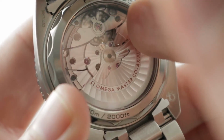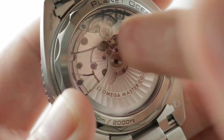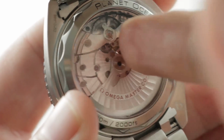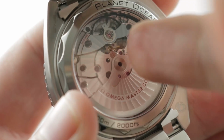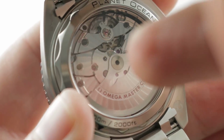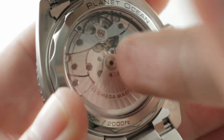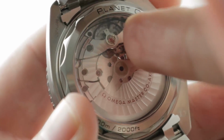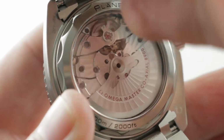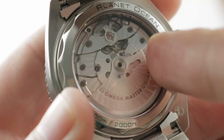The watch beats away at 25,200 vibrations per hour, and you can see the shuriken-like escape wheels of the tri-level coaxial escapement just below my finger. It's actually visible, and it's quite a thing to watch. Mesmerizing it is. And it was invented by George Daniels in 1974, first industrialized by Omega in 1999, 20 years this year. It is now both precise and durable. Short-term timing stability, long-term timing precision, and reduced maintenance requirements. One of the reasons Omega backs these watches with 5-year warranties.